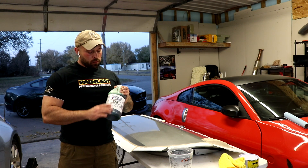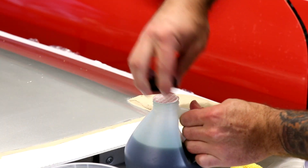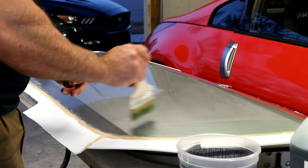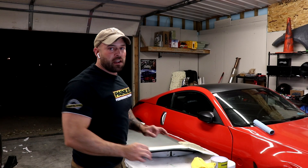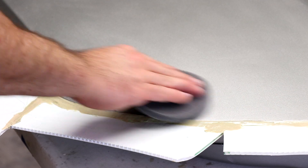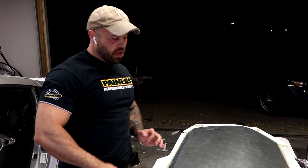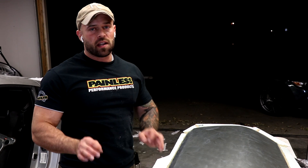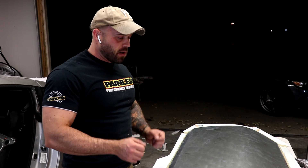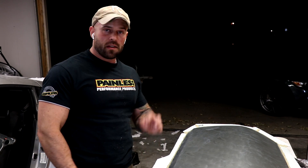Now that I've applied the wax around the border and filled all the little gaps, I'm going to apply PVA — a mold release agent — and then after it dries, apply wax on top. It's been about 30 minutes and the PVA is cured. We applied a pretty heavy coat of wax — even to the signboard on the outside. It shouldn't technically need it, but I really don't want any issues when I pull this mold. This is just like normal automotive wax. We're going to let it sit, let it get hazy, then buff it off with a microfiber towel, and then apply our gel coat.